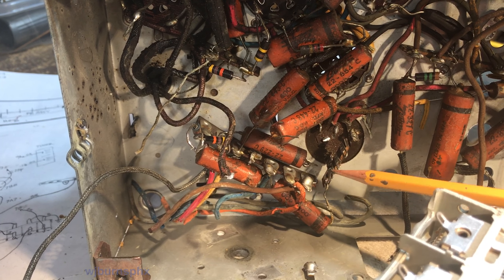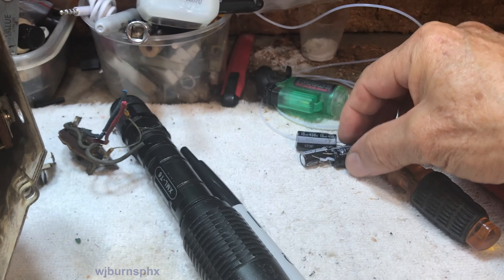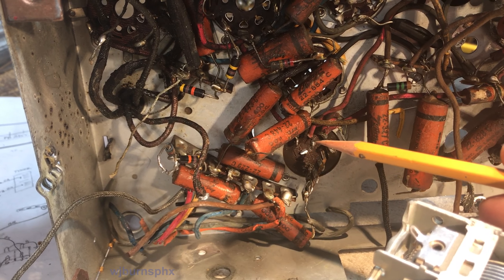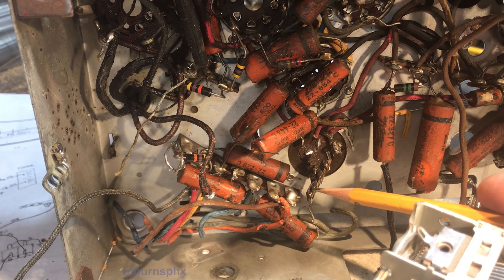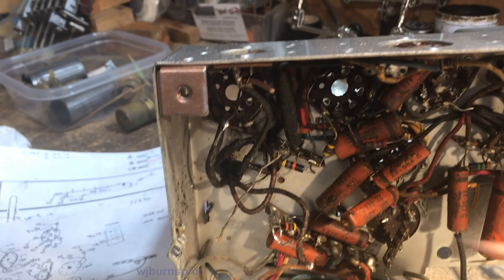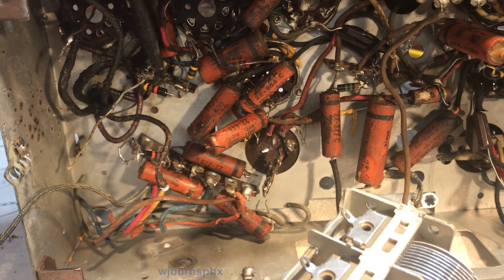I'll be making connections to that for the things that connect to the B minus line. The new caps are going to be mounted — at least two of them. The small 4.7 microfarad and the 15 microfarad are going to get mounted to the other two rungs here, and then the negatives will connect to the original connection points. We got the other 15 microfarad cap clipped out and gotten rid of — it's sitting over there awaiting its final flushing.